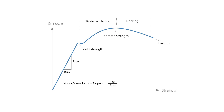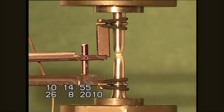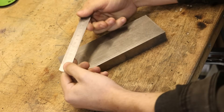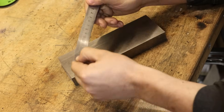Now I'm sure quite a few of you will be familiar with one of these. This is a tensile test diagram showing stress and strain on a material. It just shows how a material behaves when it's loaded up under a force. These are usually derived from a tensile test, effectively using a hydraulic press to pull a piece of material apart. In this video we will see a very similar graph, although the biggest difference is that we're going to be looking at bending. And I think it's worth pointing that out, because when we do bend a piece of metal, we also have to remember that the shape of the metal itself is going to affect how it behaves.